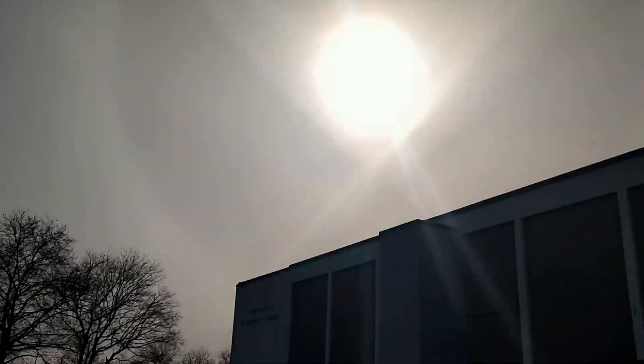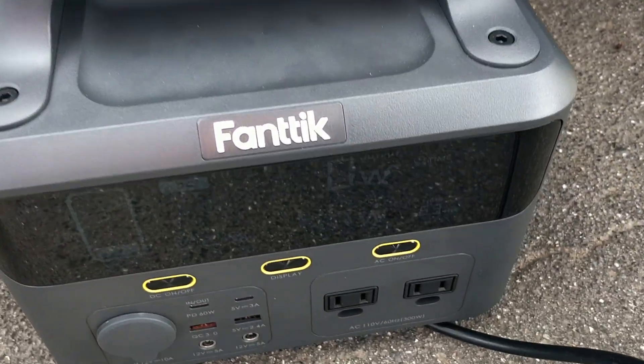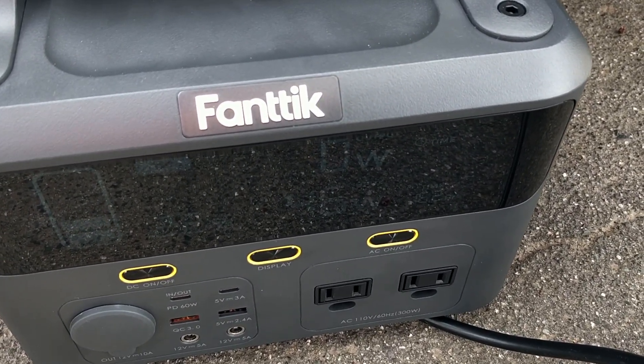In theory the solar panel can yield up to 100 watts, but real output depends on weather conditions and light exposure. You'll get the best results on a bright sunny day with direct sun exposure between 11 in the morning and 4 in the afternoon. Testing in various conditions: on a rainy day I only got one watt of power; in full sunlight at 8 in the morning I saw 24 watts; by 10:20 in the morning with light haze the panel yielded 50 watts; and at noon on a particularly sunny day the panel even reached 105 watts, exceeding its rated power by 5%. At a steady input of 50 watts, the solar panel will charge the power station within six hours.